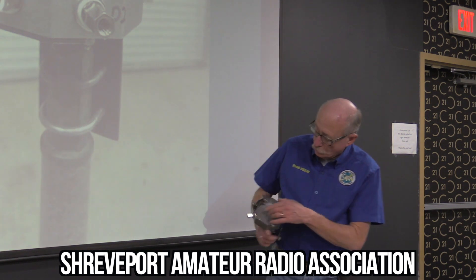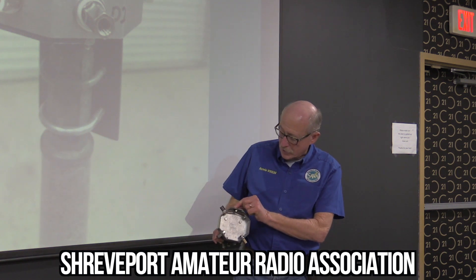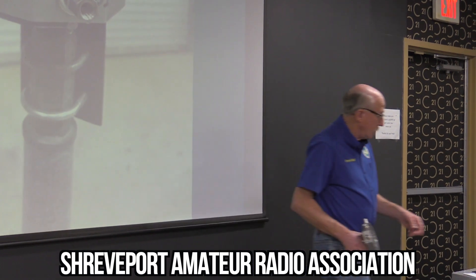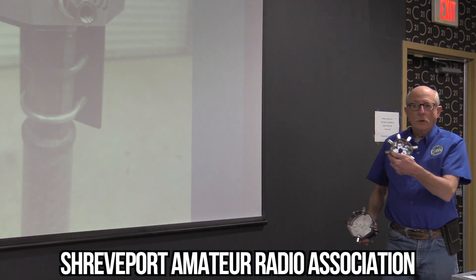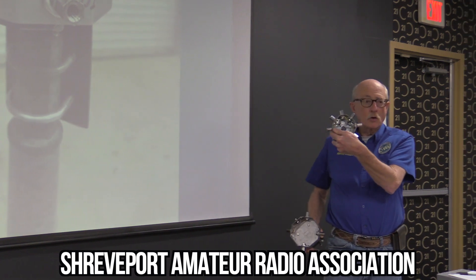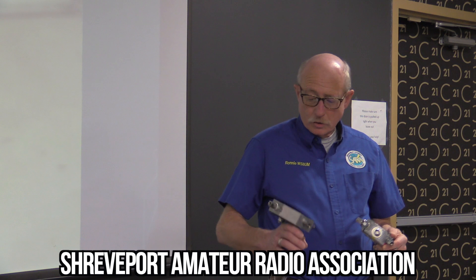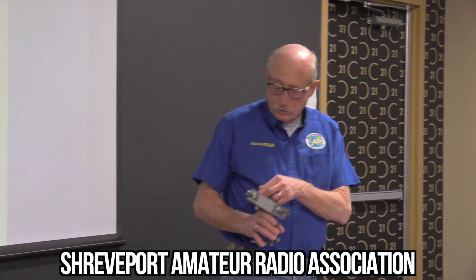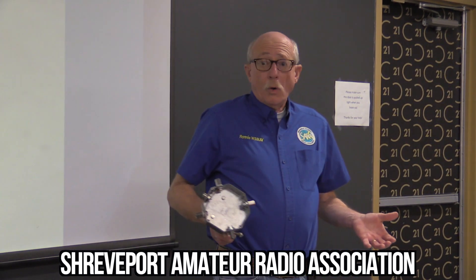I just used a piece of copper strap to go from the antenna connector to my two driven elements. Jim has used heavy wire on this — good 12-gauge stuff and ring terminals. You can do it any way you want. Randy Harner just used copper wire that he soldered to everything. As long as it works, it works.